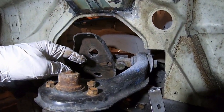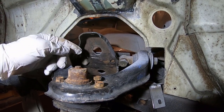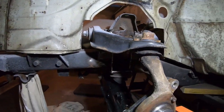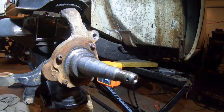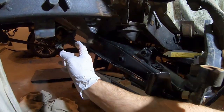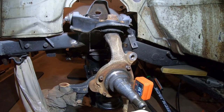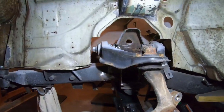The problem is camber — your camber is 86 degrees. You want that to be 90, or zero degrees. To make it 90 you'd have to pull the crossbar backwards, but you can't because the frame's in the way. That's why I had to cut the frame on the other side. If I mount the crossbar on the inside it's the same problem — it's got to come over quite a bit. So this frame completely gets in the way of getting good alignment. Now if you like 86 degrees or minus-three degrees of camber — which seems to be a trend in some countries — then this stock D21 uncut onto a 521 frame is for you. I measured the distance between the bolts: the junk here is like 20 inches; on a hard body it's like 16 — a huge difference.